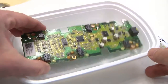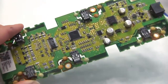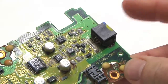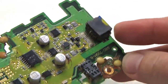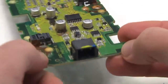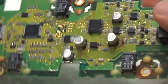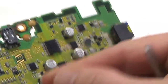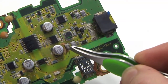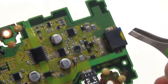But if you look at this BMS board, we're going to get a close-up here and point a few things out. Up on this end, that's where the connector goes from the battery pack's wire harness to the BMS board. It wasn't too terribly corroded — not great, but not awful either. When I was examining this board when it was still covered with rust, one thing that was pretty noticeable was right here: this capacitor was blown. You can still see marks from where the stuff oozed out of it.